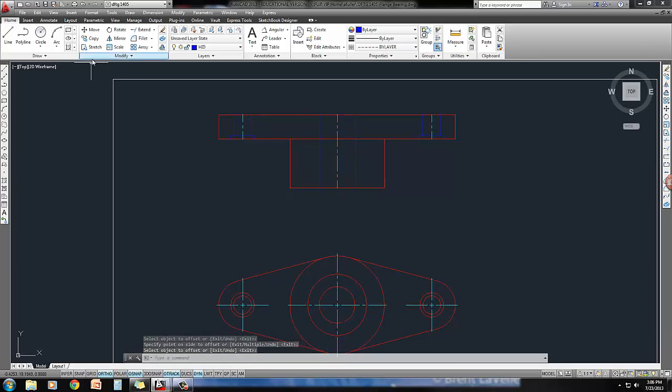Now what I need to do is, again, you could offset or you can O-track. I think I'm going to choose to O-track on this particular one. I'm going to acquire that largest diameter, so this is that diameter of 2.5. I'm going to project that up so that I have a starting point, and then I'm going to draw an angled line. And so, as we learned during the lecture, if it says it's got an 82 degree countersink, the angle actually from zero up is actually 49 degrees.